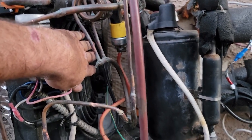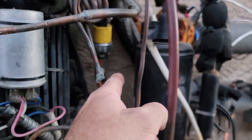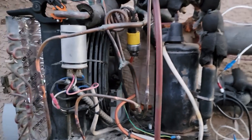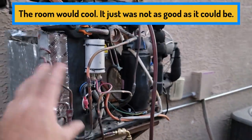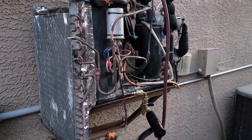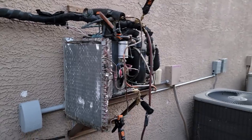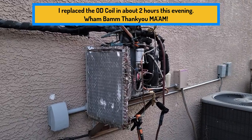It's basically a secondary heat exchanger now — the primary one's the tube-and-tube back there to the circulating pump to the tank. Usually heats pretty good; it's just that the room wasn't cooling very well. A little too much hot gas, wasn't feeding very well, needed to reject just a little more heat. I just said screw it. We'll see how it goes — this is just a continuous Frankenstein project. It's taken abuse and it just keeps on running, man. It's pretty cool.